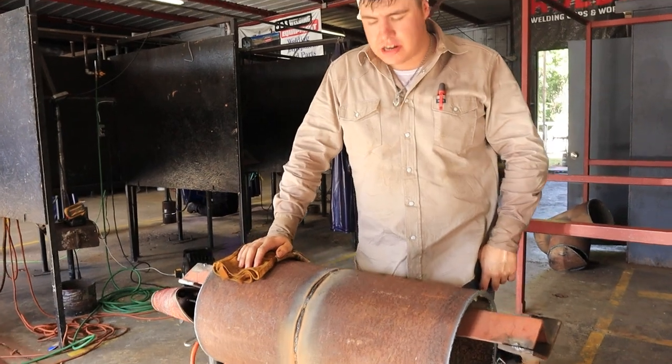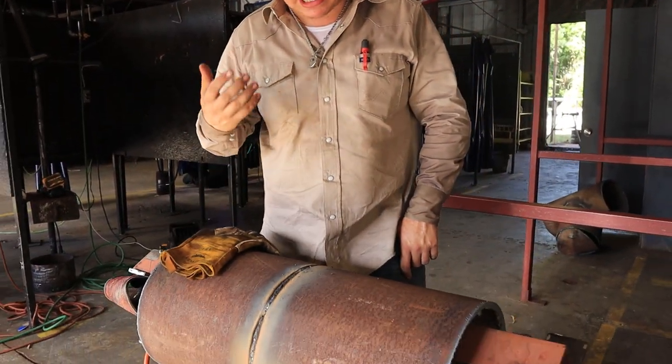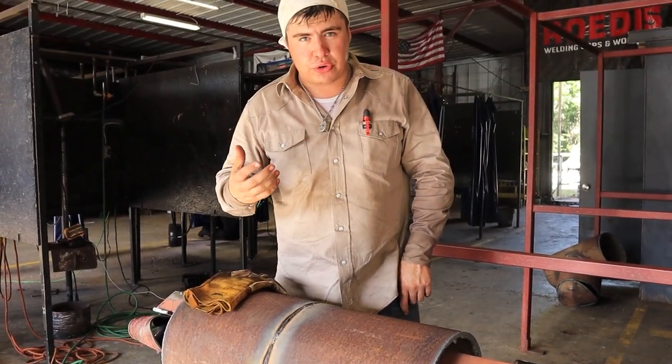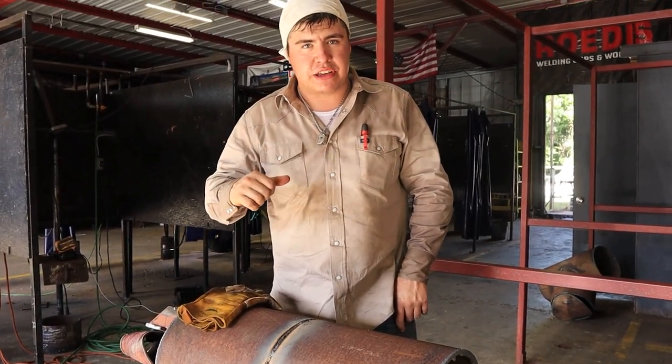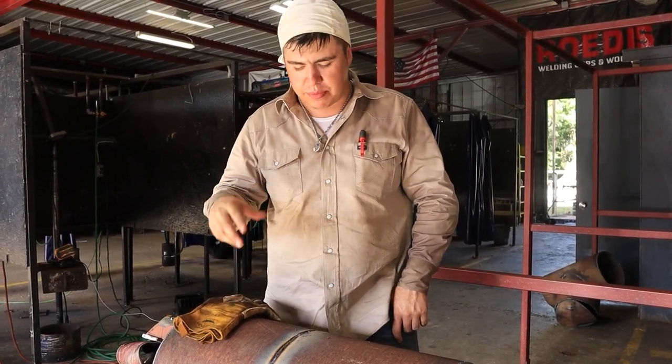All right guys, we just got done putting in the hot pass. The whole purpose of the hot pass is to get any trash that you have out on your root and to push your root out even more into the pipe, making sure you have enough penetration on your pipe.